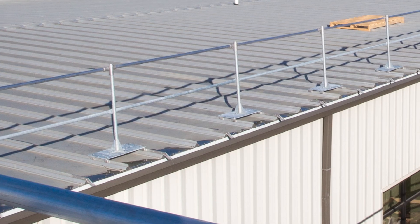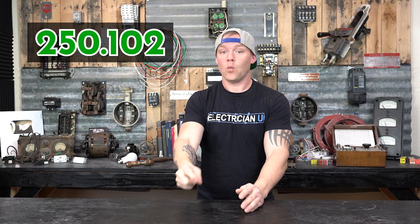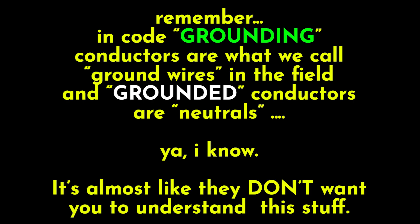Lastly, lightning protection systems — running large ground rods in the ground — need to be bonded to the regular electrical system to make sure they're at the same potential. These two different grounding systems should be at the same potential. You can read a lot more about this in 250 Part V, but 250.102 is a number you need to burn into your head, because that's really what talks about using bonding jumpers to bond our neutral and our ground together — not just two pieces of metal, but more specifically bonding our grounded and our grounding conductors together.